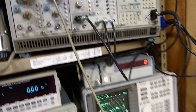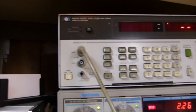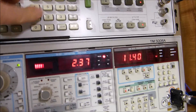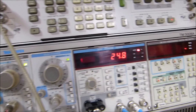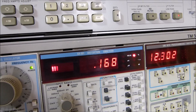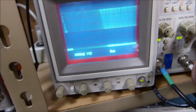We're going to use this wonderful old HP 8903 to do all the tests. Starting at 1 kilohertz, amplitude 1.5 volts - there's the THD right there: 0.16%. It agrees with the Tektronix reading of 0.16%. That's at 18.92 watts. Here's what it looks like on the oscilloscope - looks very good, very little error signal on the output. I'm really quite impressed.